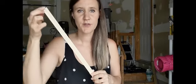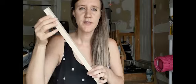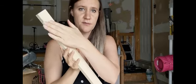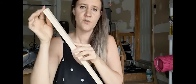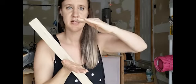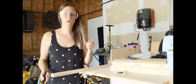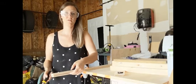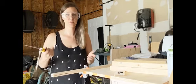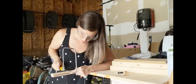The first thing we're going to do is cut along this line using our saw and take a little piece out, because we're going to mount this on our wall and it needs to sit over our baseboard. We'll attach our hinge to this piece and it's going to open up so we can drop the gate down to where the baseboard is — that way there's not a big gap by the stairs where she'd be able to fit her head underneath. I've got a coping saw — you can really use any saw — and I'm cutting where I marked the height of the baseboard to be.